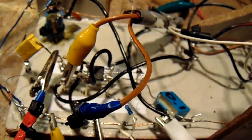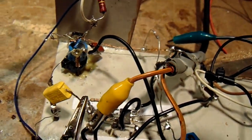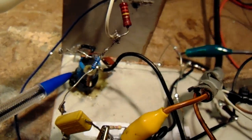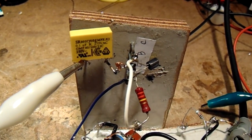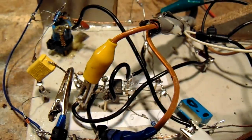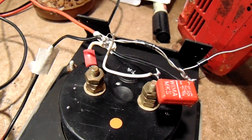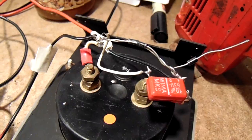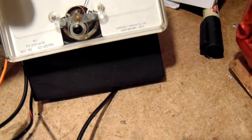I built it in the way I always make my circuits — with brass nails on a piece of wood. You can see the decoupling unit, input circuit with the BC547B, and the 555 in the middle of the screen. On the backside of the meter are the two anti-parallel diodes and the one microfarad non-polar capacitor.